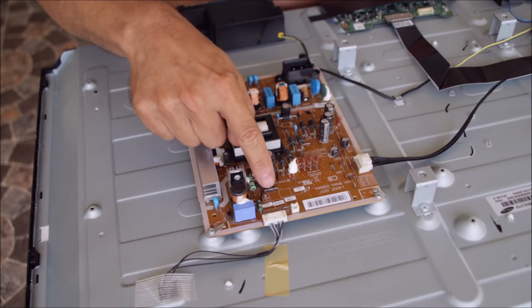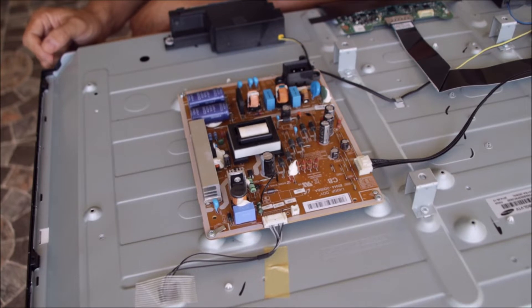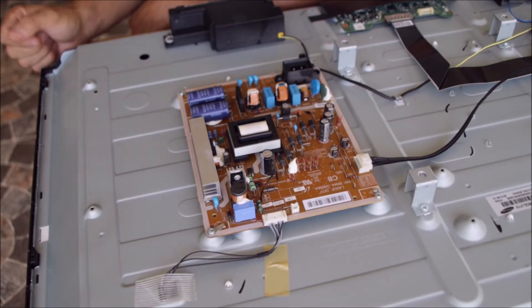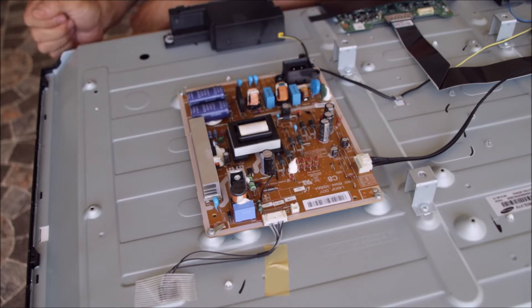So this is just a wire which goes from there to there and then is connected to another one which goes 90 degrees the other way, and nothing else. These jumpers are just metal pieces of wire and one of them just burned off. I took my multimeter and measured all components — they're all working. There's no shorts on the board, absolutely nothing other than a burned jumper. So how can that jumper burn out? That is really a mystery to me, because those jumpers must be from the design and are completely overrated anyway. So what sort of currents can go there that jumpers like that can burn out?